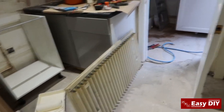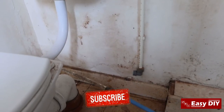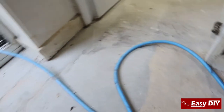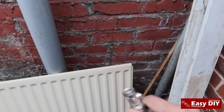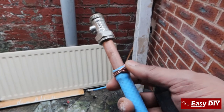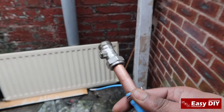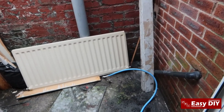I'm using a hose pipe. This is a toilet downstairs and I've managed to take a pipe from the toilet and use the hose pipe on one of the stop valves here. On this end I've put a 15mm plastic pipe on another stop valve which will screw into the radiator. On the other end I've got another hose pipe. I've put copper wire tied around so the seals are nice and tight — it's just temporary. I've just made this now and I'll be using this to flush the radiator.